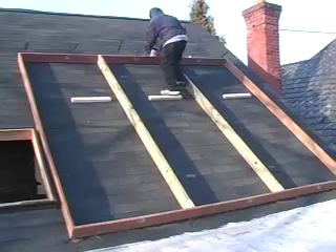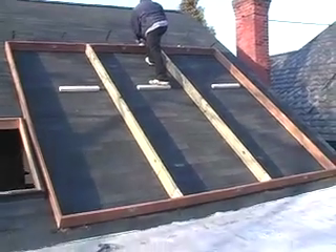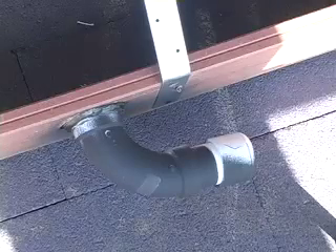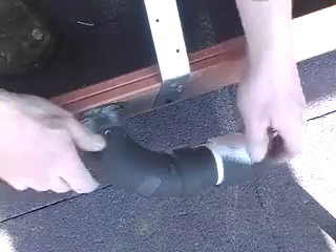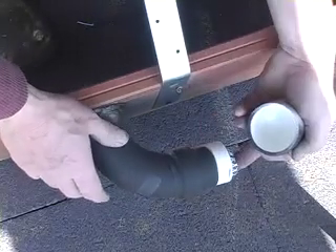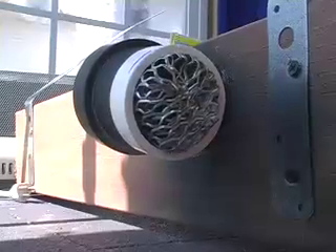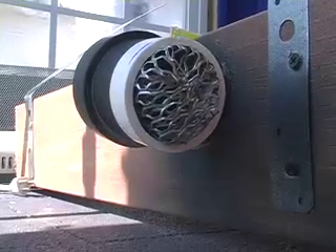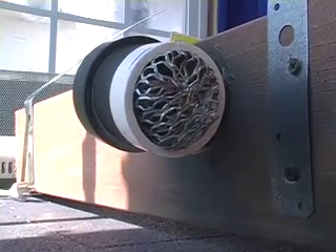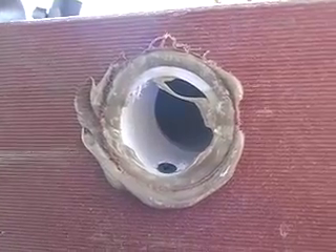Here's my one-by-six box on the roof, which is going to contain these collector panels. I put vents at the top — regular two-inch water pipe — that's to open up in summer so this thing doesn't get too hot, because it gets really hot. There's some mesh in the end to stop critters from getting in. I open these up in summer because it gets to 200 to 300 degrees inside these collectors any time of the year.